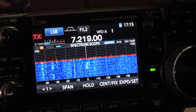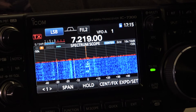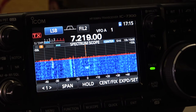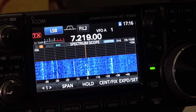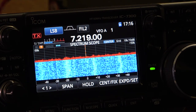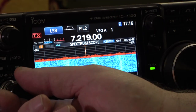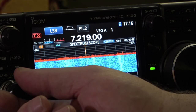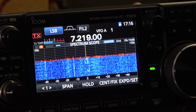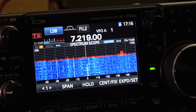40 meters, AB switch. Right now we're on B, which is the main antenna. And the RG8X is to the ham stick. And I'm getting more noise on the ham stick. I'm still picking up these guys that are talking, but they were 5 by 9. Got an S7 noise floor, but it seems to do the trick for a receive antenna to null the noise out.